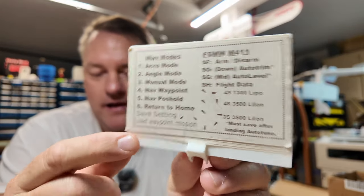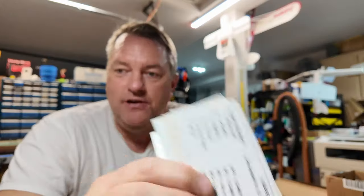I print these on a label maker. Some of these things look like a battleship — there are about 10 labels on there. I no longer do that; I just clip them into place and leave them there because I fly a bunch of different airplanes, all with flight controllers. If you're in the flight controller business, having notes you can refer to while going through the basics — before you toss that thing in the air — it's nice to touch base with what switches are and what they do, particularly if you've set anything mission-critical or somewhat unusual.